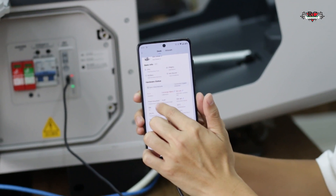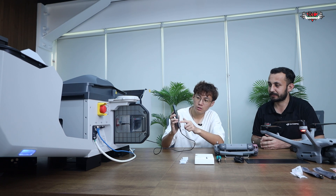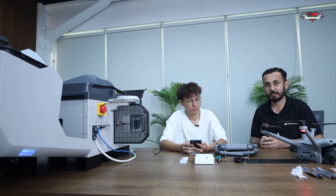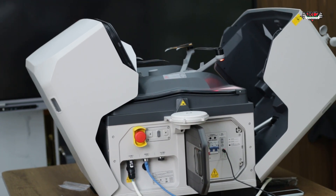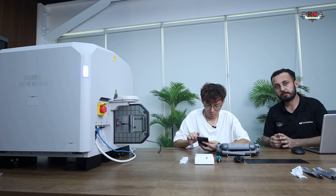This is a complete debugging page — before we could see the information from the RC, now it goes to the phone. The activation is done. The next step is to connect with FlightHub 2 for more testing. We will create an organization in FlightHub 2 and get credentials like the organization ID and binding code, then put those credentials into our system to bind them together. Let's close the dock cover and charge it.